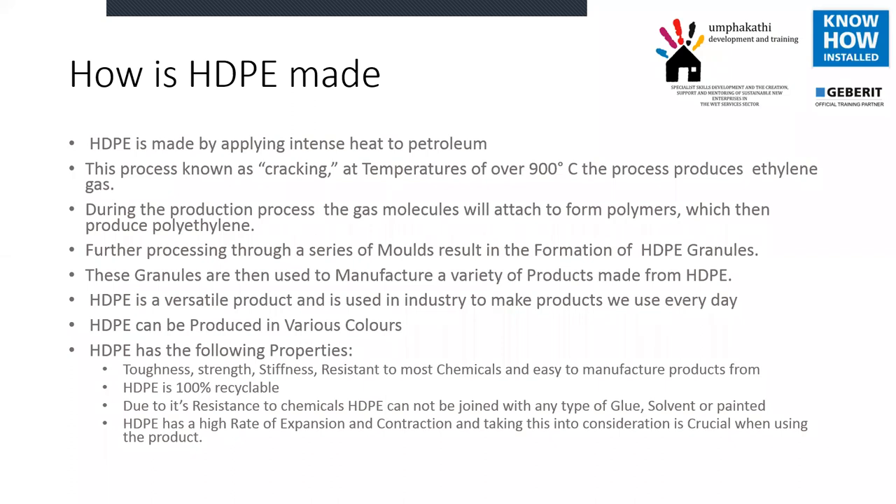The advantages of HDPE is obviously it's a very tough product, and once it's prefabricated or made up in pieces, you can throw it off a building and it'll bounce provided you've done the welds correctly. If you were to ride over it, it'll come back to its shape. The other good thing about HDPE is it's 100% recyclable, and even the smallest pieces can be reused again — joining between junctions, bends, etc. — so your waste factor should be a lot lower.